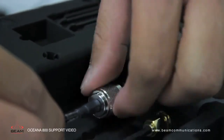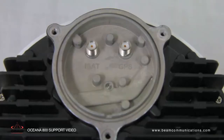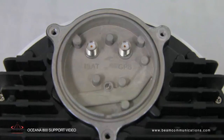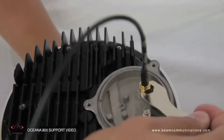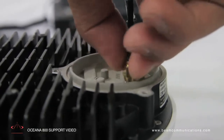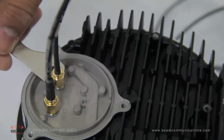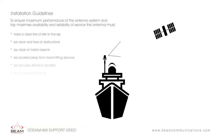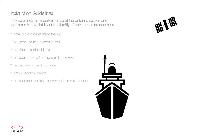Avoid over-tightening any antenna connectors. At the other end, connect the antenna cable labelled INMARSAT to the SMA antenna connector labelled ISAT, then connect the antenna cable labelled GPS to the SMA antenna connector labelled GPS. You must ensure the antenna is positioned correctly with no obstructions or tall structures that could block the signal between the antenna and the satellites. We have further videos in relation to antenna placement for your reference.